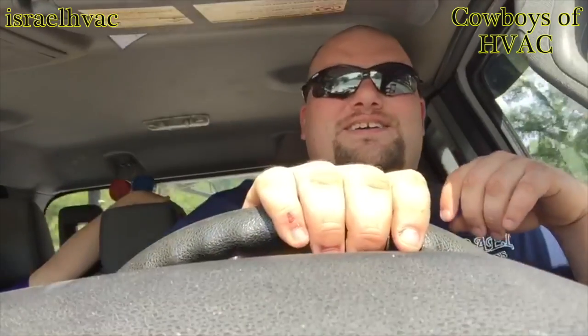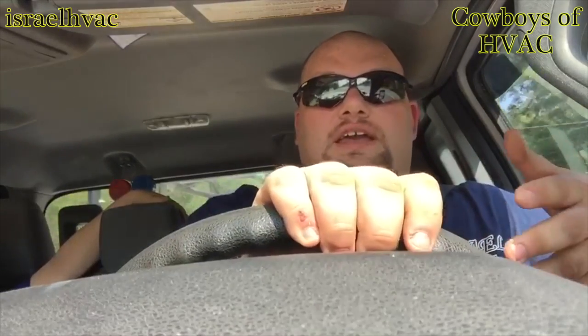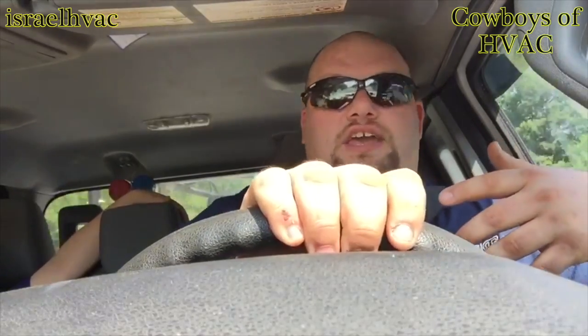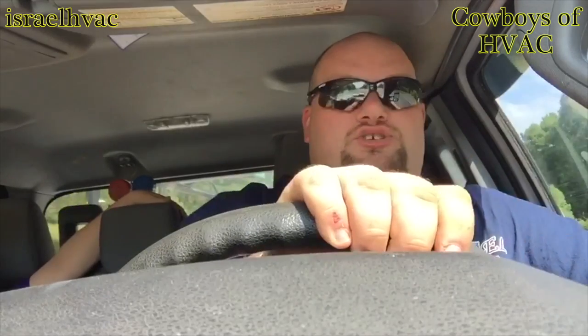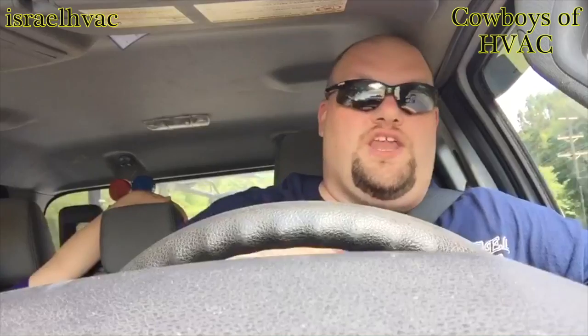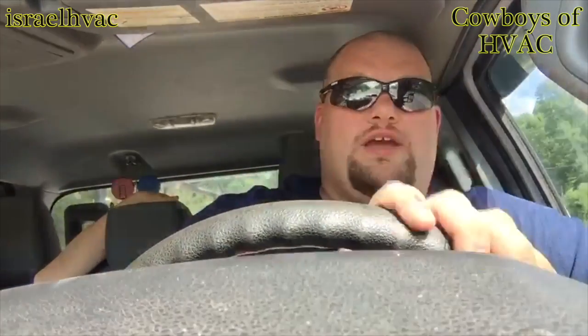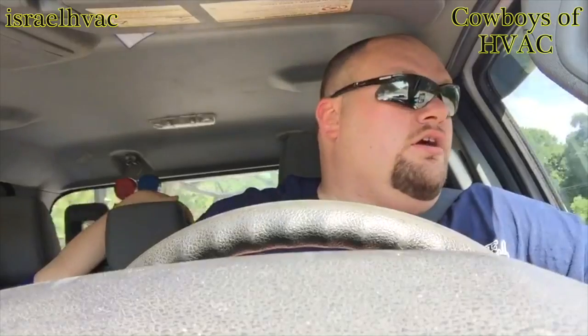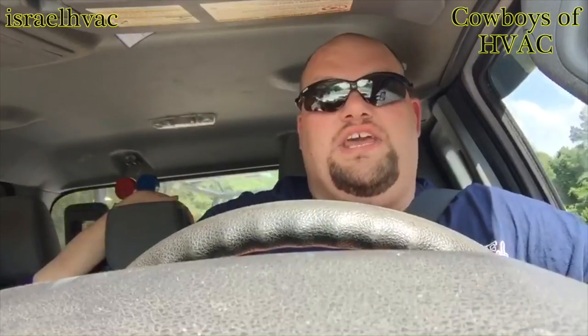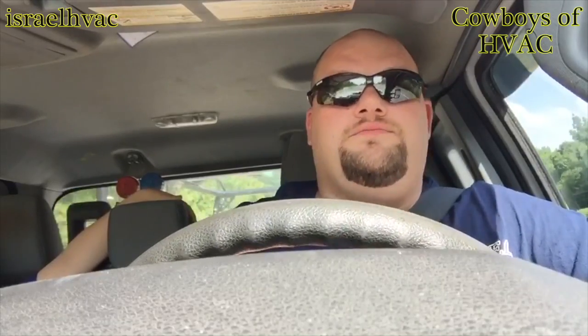The way he's describing it, it sounds like the compressor's not starting. He said he can see the outdoor fan running, and then he hears a hum every so often. Sounds like the compressor's trying to break free, probably due to a bad capacitor, especially if it's got one of those Chinese capacitors on it. So we're gonna go over there and see what it is, and we'll film what we can for y'all.